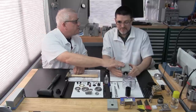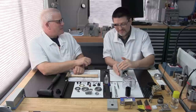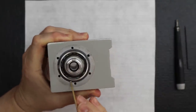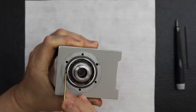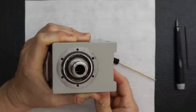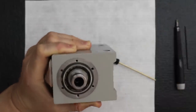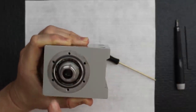And then there's the factory's headstock tolerances. They may be at their high. So if two highs run into each other, you need your tool. As you can see, this retainer ring is a perfect size. It sits right inside that recess on the headstock housing. It's not flush to the body on the outside, but it's right inside the recess, as far in as it can go. Perfect.